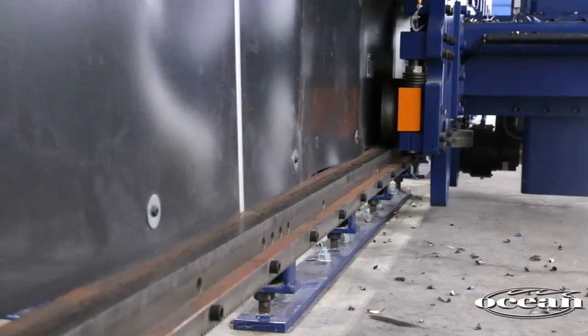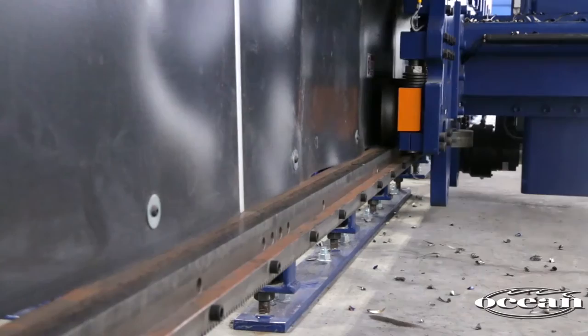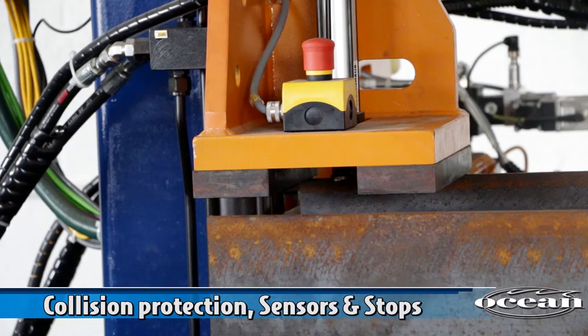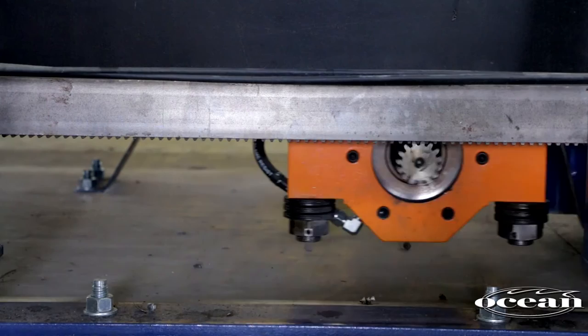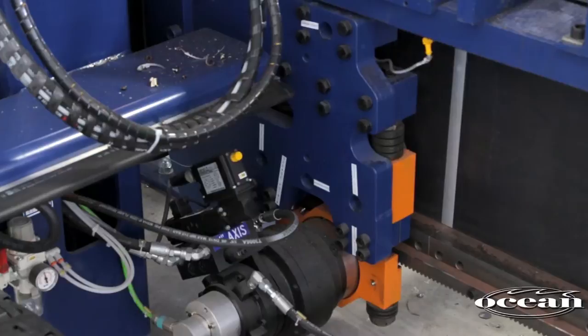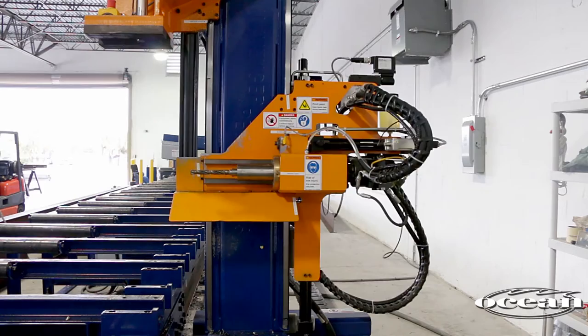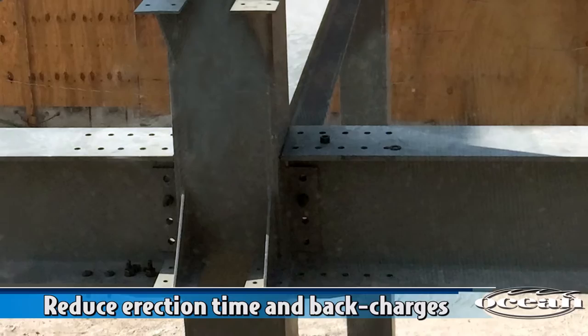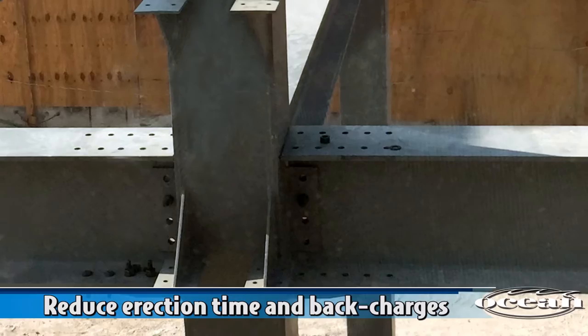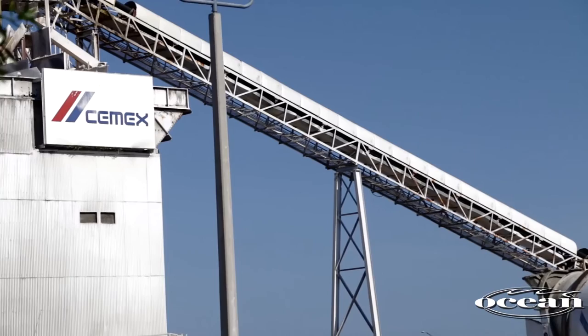The moving drilling platform is cantilevered from the side of the machine and travels in high-precision guide rails, and does not actually touch the floor. The drill line is built to international safety standards with collision protection sensors and stops. Positioning on the longitudinal x-axis is accomplished by an exceptionally accurate rack and pinion drive and measuring system. The positive engagement system eliminates any slippage and ensures precise positioning and drilling. The vertical positioning of the drilling head is accomplished with a heavy-duty hydraulic cylinder moving on linear rails, with an encoder providing absolute positioning accuracy and exceptional rigidity. Accuracy in the x and y-directions are within 1/32 of an inch, ensuring fast and reliable on-site erection of your structures.